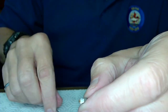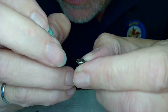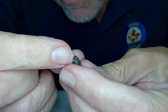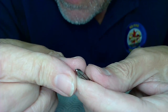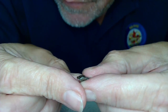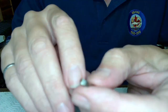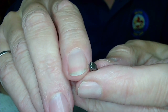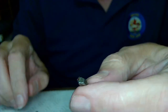I think that's actually down to nothing, so I'm going to take some Rodico now and just dab it here to get rid of any filings — this jewel should be fine. When I was actually putting this jewel in place, I pushed the jewel up a bit through the shellac so it got adhered, then pushed it back down through the hole to make sure it was really secure.